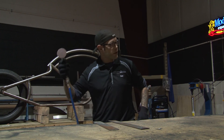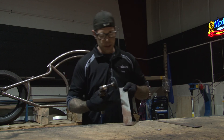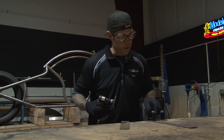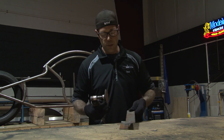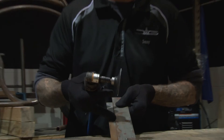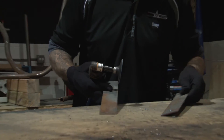I'm going to take our air sander and take this down. You're going to see all the rust that's right here — I'm going to take this all the way down on this side, and do the same on this side. We're going to do a fillet weld directly across here, and I'll show you how to do a proper weld and a weld without the shielding gas as we go forward.